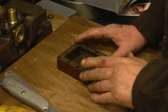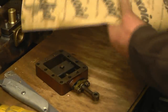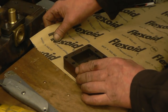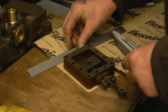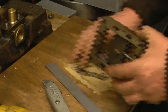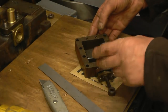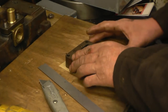There are quite a few gaskets to make for this engine — the thing is, on a steam engine they're not called gaskets, they're called joints, so I've been informed. I've got some joint material here, made in England. I'm going to cut a piece out roughly the size, and then once the engine's assembled we can trim it to be a good fit. I need to put the holes in for the studs. All these holes are a bit off — they're oval, not quite in line — but they do fit on the engine. There's nothing much I can do with that; it'll work perfectly alright the way it is.